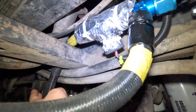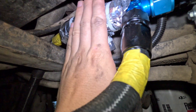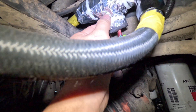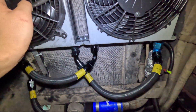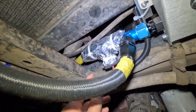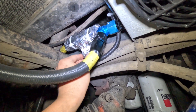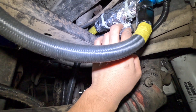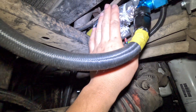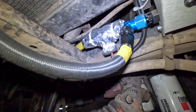Here's the input line from the transmission. This is the thermostat underneath, wrapped in foam with aluminum tape — underneath is the thermostat that triggers the two big fans, each of them 800 CFM, with 12-AN fittings. The foam and aluminum tape are there to retain heat so the thermostat trips at the correct temperature, rather than dissipating heat through the metal fittings.